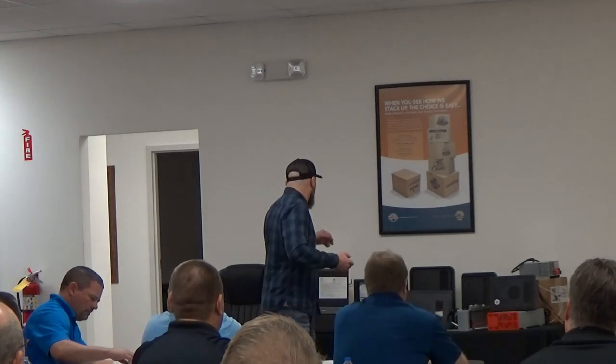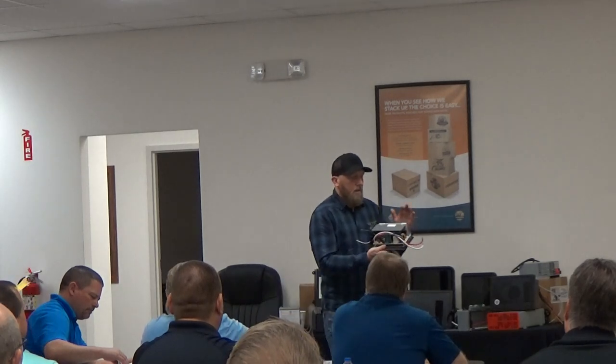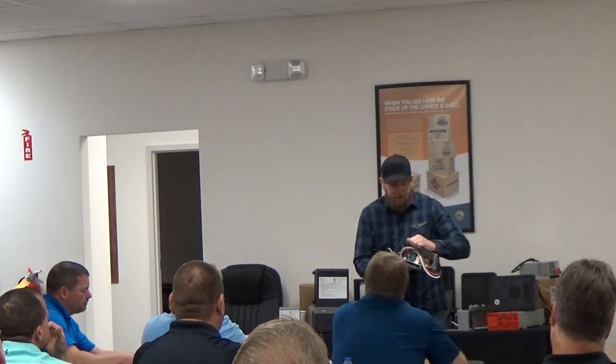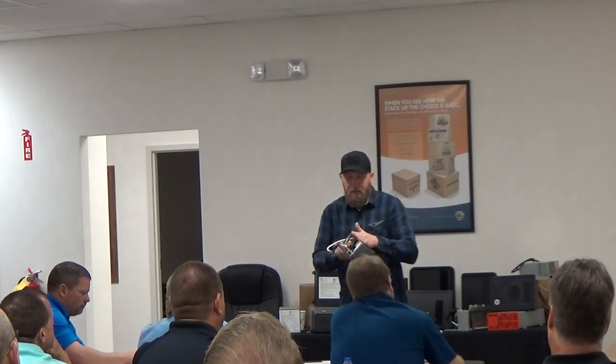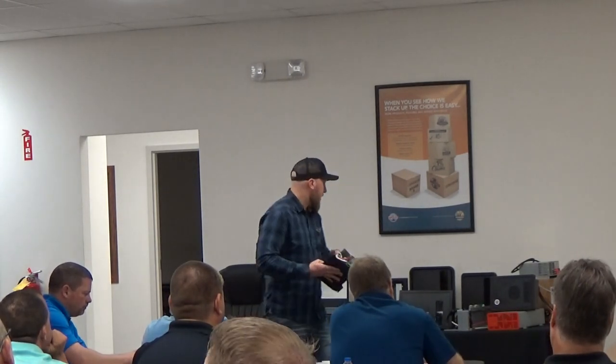We'll talk about this a little bit later as well, but this is what goes in the bottom end of that 8955. This is what they can slide in and out if it goes bad. There are two components on here, these two little guys that look like little batteries. These are capacitors. If those are blown, they took a power surge or a lightning strike. Something with high voltage came through and got them.